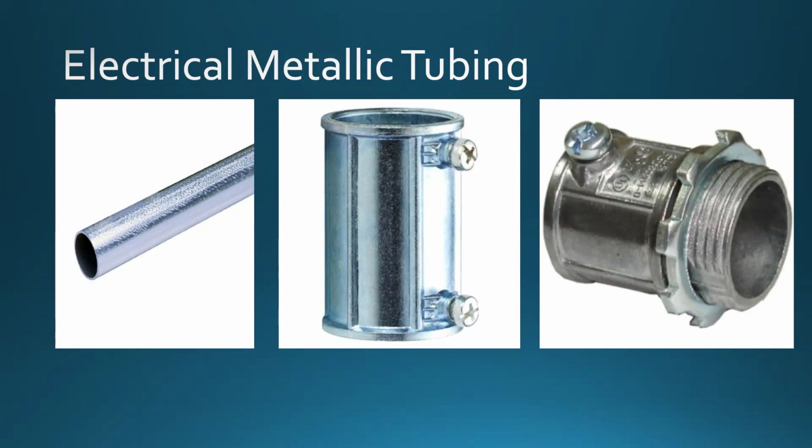The pipe usually comes in sections of 10 feet. Because it's, well, relatively easier to transport. Longer sections are not that uncommon. However, the most common bulk section type of packaging is in the sections of 10 feet. Now, if you have a long wall in some production hall and you need to install the EMT, then of course it's going to take more than 10 feet to run that raceway. So in that case, you would be using couplers, and those couplers, these are the set screw couplers.